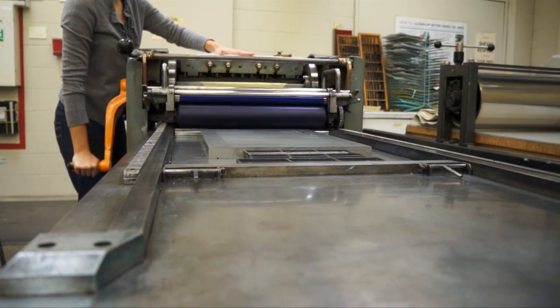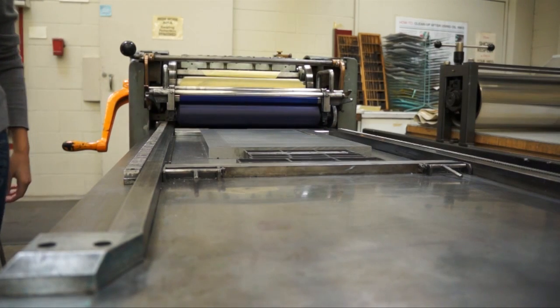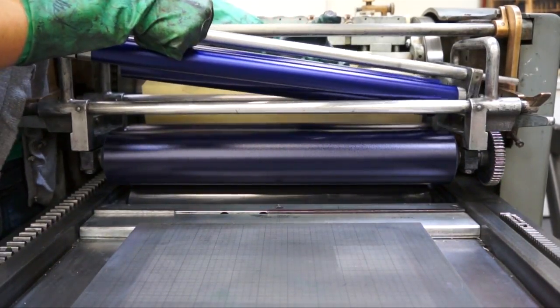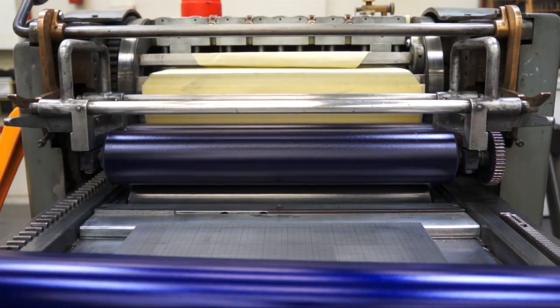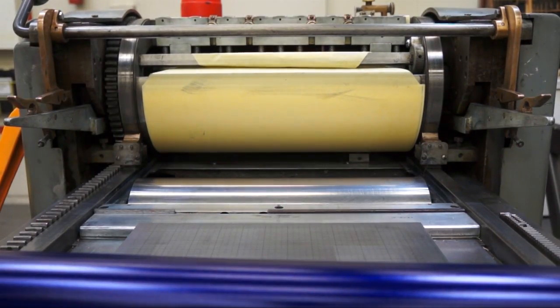From this view, you can see how the tympan rolls all the way down to the end of the press bed and clicks to release the paper. Cleaning up is one of the most important things about letterpress printing. When you are finished with one plate, remove it and return it to its backing so that you don't lose it. Now a thorough cleaning of the Vandercook 219 will be demonstrated. It is imperative that you wear gloves when cleaning to protect your hands from the chemicals. The first step is to remove the top assembly — you must lift it up, bring it all the way to one side to get one side out, and then lift it out. Removing the bottom assembly is easier: simply lift the little copper locks and slide it forward.